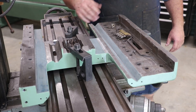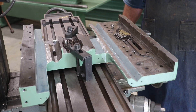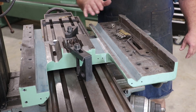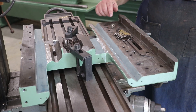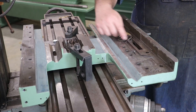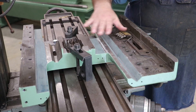We had worked on this previously. In an earlier video, we went in here and milled this out, put new Turcite in here to get this ready, building up these ways that were worn. But as I was working on this the other day, I realized a problem with the lubrication system on the whole saddle apron. There's a distribution block here and another one here that put oil in different places. Oil comes in from a reservoir up in the apron that pumps oil as the machine is being moved, and it distributes oil in strategic places to keep things properly lubricated — the ways, the gears, et cetera.